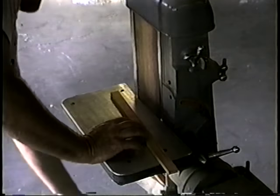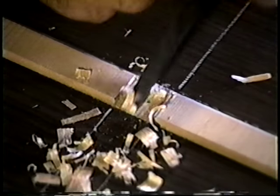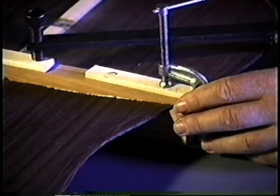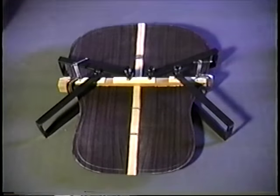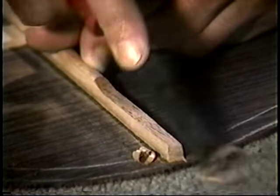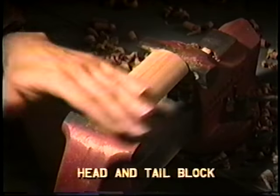We used the belt sander to shape the braces, keeping the gluing surface as smooth as possible for the strongest bond. Where cross braces intersected, the center strip was cut away. We made cauls matching the curve of the braces to hold the back properly curved while glue set. Braces should be glued in one at a time using plenty of clamps — don't glue all braces before the glue sets because the stresses will work against the clamps. The final step is shaping the braces: we rounded the top and tapered the cross brace ends, using a simple taper on the steel string and a scallop shape on the classical.